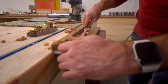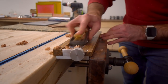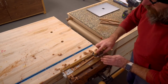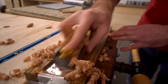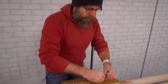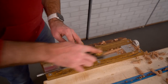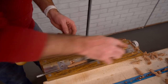I get really close to that point and then I rotate it and do the next side. Another notch. You might notice that while you're running your plane over there, there's a little bit of flex. So it's going to come with this little piece of rubber that you can stick in the bottom here — that'll help take out that flex — and I'll do my final passes on each side. It bottoms out when you get no more shavings; you're done with that side.